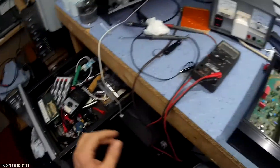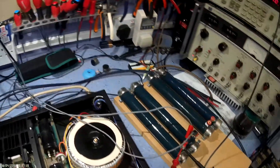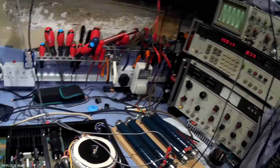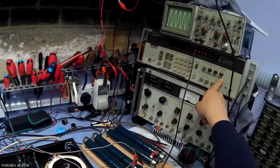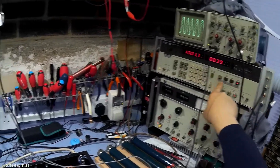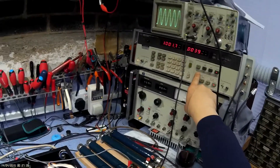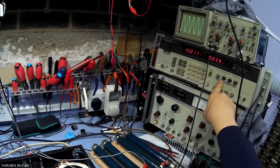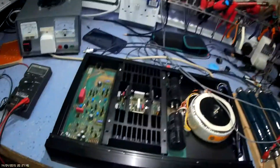Just stay with it, make sure it doesn't overheat. I'm sure it should be absolutely fine — I've been through everything — but I just don't want to blow it up again. This is running into one kilohertz. Distortion is 0.039%, which is basically as low as the signal generator and analyzer will measure. So the distortion is excellent — it's clean, nice, clean waveform.